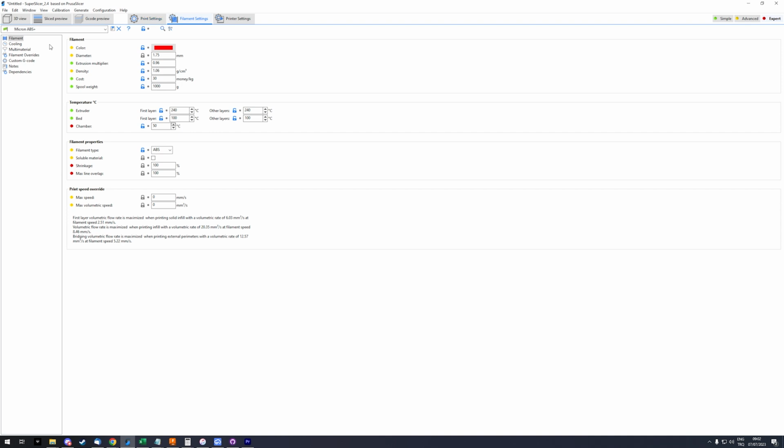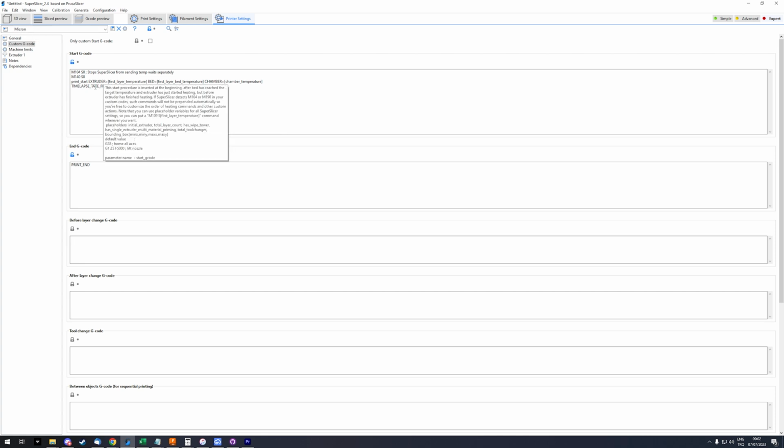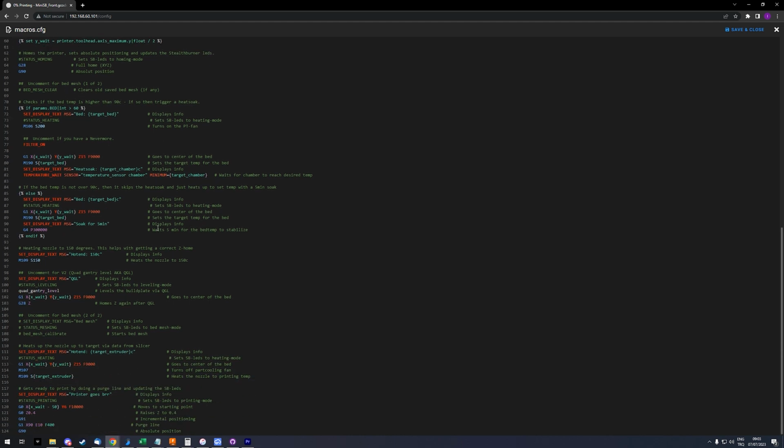I think I'm still in the process of tuning this, but yeah, anyway, you set that, and in the custom G code in the printer settings, you export the chamber temperature along with your extruder and bed temperatures, and the print start macro starts heating the bed, turns on the fans, etc., and just waits until the chamber reaches the target temperature, which means you don't have to deal with preheating the bed, and yeah, you'll get the best possible results. So that's one of the things I really like about the script, and it also does a purge line, as you saw in the video, but as I said, I need to tune that. I did tune it a bit, still needs some work, but yeah, the purge line is here. So yeah, again, if you're interested in this, it's linked in the description below.